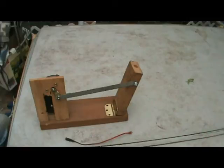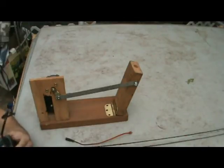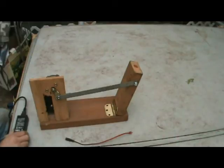This power supply is a 12-volt, 5-amp power supply. That is ideal for running one of these wiper motors. If you sourced one from a thrift store or a PC place, it's probably not going to be a 12-volt, 5-amp power supply, just because in computers, that seems to be pretty rare. It could vary, but the closer you can get to 12 volts and 5 amps, the better.